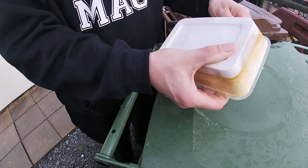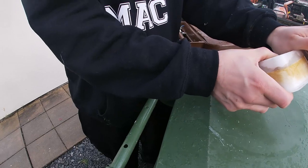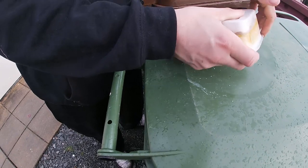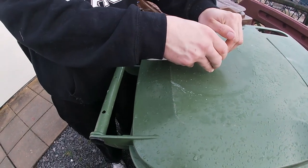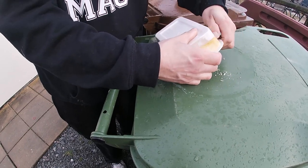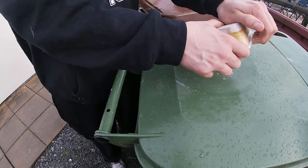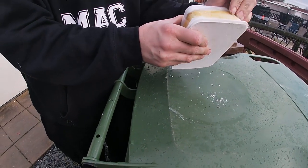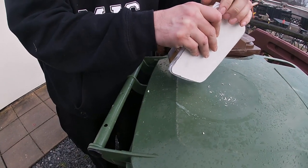Trying my best to release it cleanly. The plan was to keep the original model — the reverse — and the tub, but as you'll find out, sometimes plaster really does bond well. So I kind of have to break the plastic to get it out. Something that it would just release easy enough — that's one thing about plaster: if it locks in, it surely does lock.